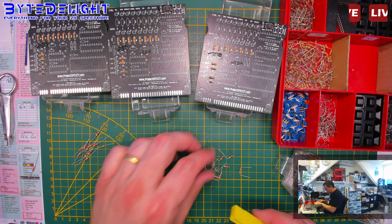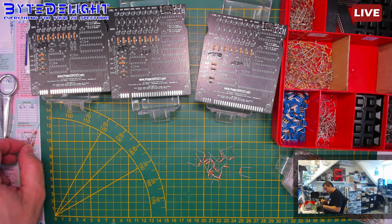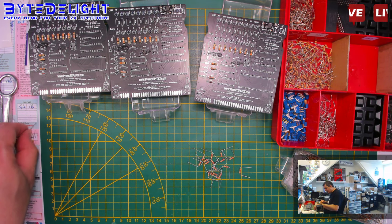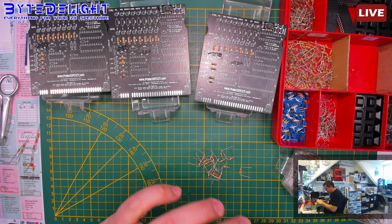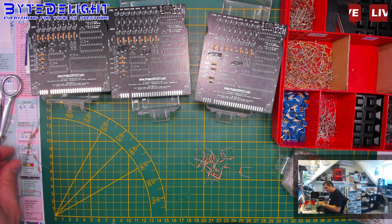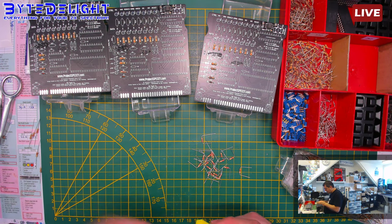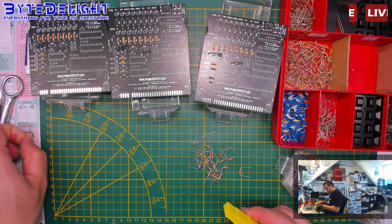The thing that comes closest to making an automated machine is the setup I made when I was creating a V-cut in the ZXHD boards that came in without a V-cut. So I did it myself and it gave quite a lot of dust, but it saves so much time doing it that way. I made a setup just to put the ZXHD boards on over a plate, and the V-cut was done, the same way as they do it in China. It's semi-automated. You can also use a bandsaw, of course, for cutting the boards, but it's really a lot more work than creating a V-cut.